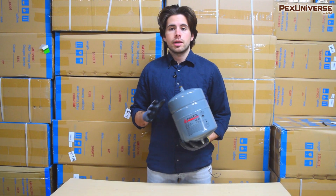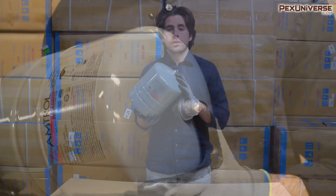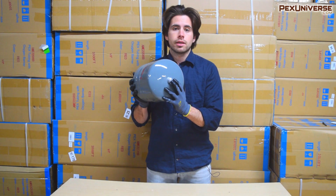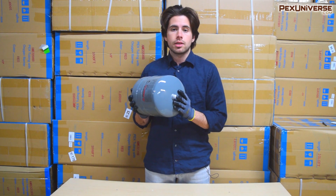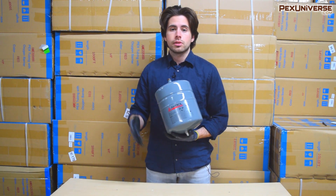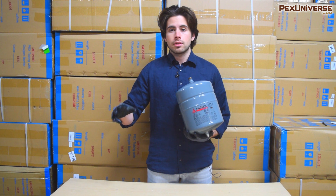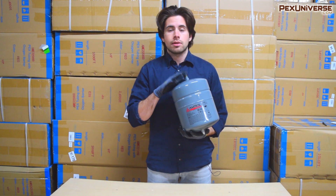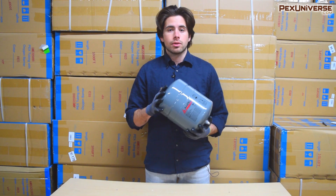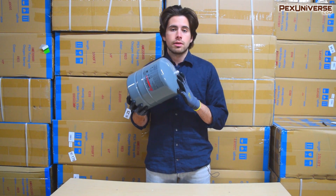Before showing the piping methods, I wanted to highlight this model which has an indicator cap on the bottom. This cap shows you when your tank is done and needs replacement — it starts out clear, but after a few years of internal rusting or degradation it becomes very cloudy and dark. Before it gets to that point you'll want to change out your tank. If the diaphragm breaks down and stops working you'll start to see leakages in your system, and in the worst case it's going to burst. So if you check your tank and see that the cap is cloudy, you know it needs replacement.